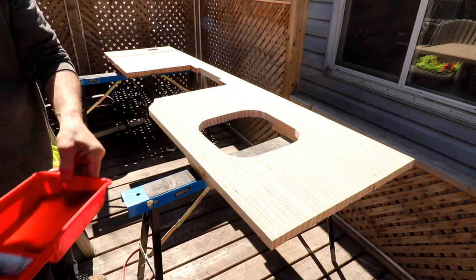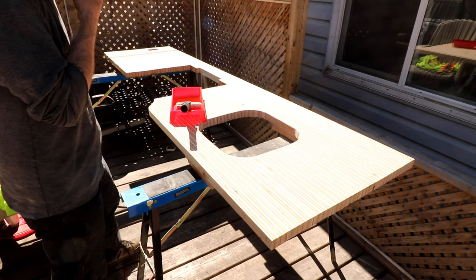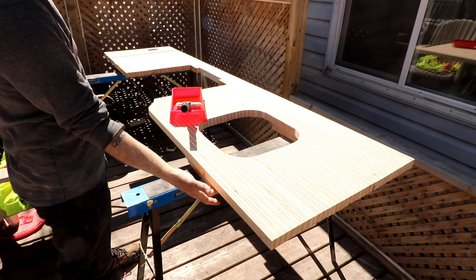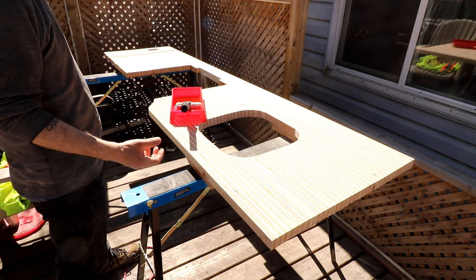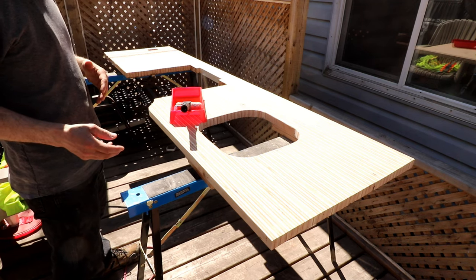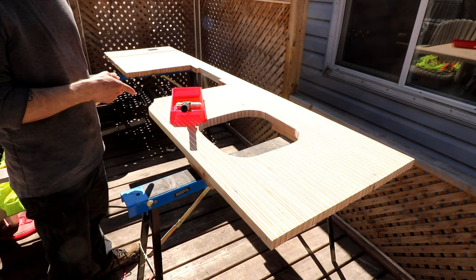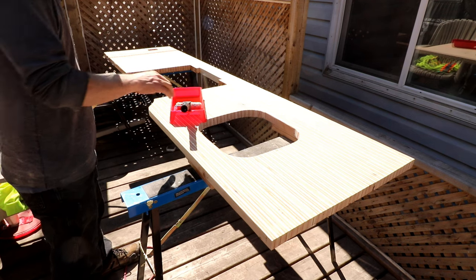So now I'm going to add tea. I know I said I wasn't going to add the tea when I was first looking at it, but when I was doing the underside of this piece earlier today, it just wasn't absorbing the vinegar stain that well. So I'm just going to add one coat of the tea first, then I'll add my multiple coats of vinegar.